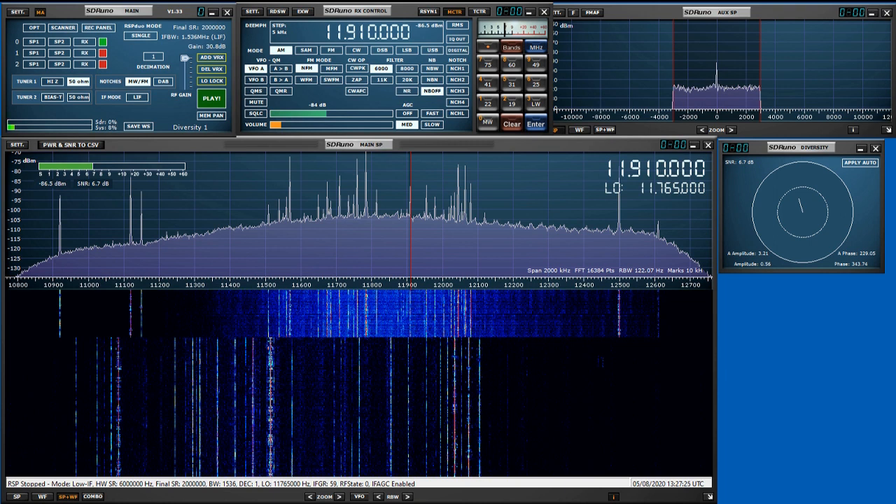So what we have set up here, unfortunately, is my normal view. It's around 7:30 in the morning and my neighbor has just turned on her kitchen lights, which are badly wired halogen lights in the kitchen, and they pretty much wipe out the 25 meter band. This house that causes the RFI is about a hundred meters to the west of me — something I've learned to live with, but it's driven me to find all kinds of neat ways to reduce RFI.